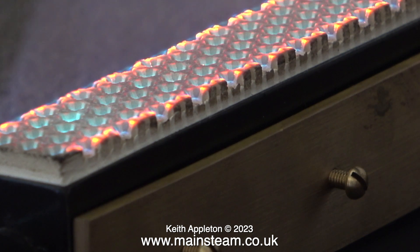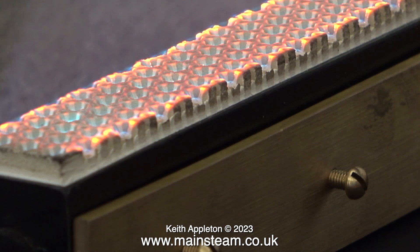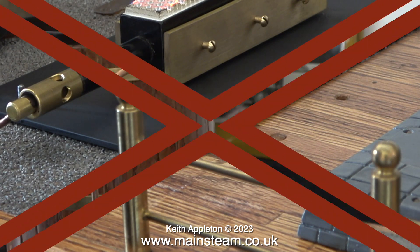I'm going to run it for a while and see how hot the burner gets. Running in real time, very slowly the burner is beginning to be incandescent — it's all down to the position of the gas jet in the venturi tube. Here's the gas jet and I've marked it with a felt-tip pen at the optimum position. If you get the burner too hot it starts to make a funny noise and burns out.